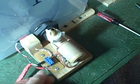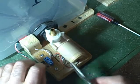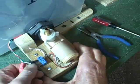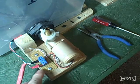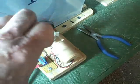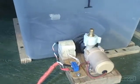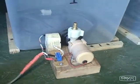Last but not least, we have the pump connections. You might want to use needle-nose pliers to make some of these connections. Make sure the power is off when you're doing this — you don't want to short these out. We have the green wire and the red wire: the green wire goes to the negative terminal, and the red wire goes to the positive terminal. You'll see a little plus sign right next to where the red wire connects. Remember, red always goes to the positive terminal — do not reverse polarities. We've installed the wires from the gray cable to tank number one, and you'll also install the gray cable to tank number two when you finish that.